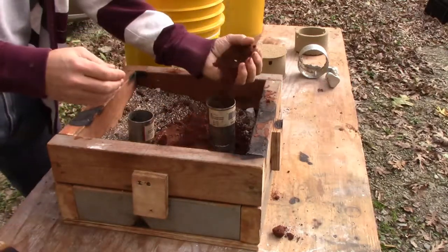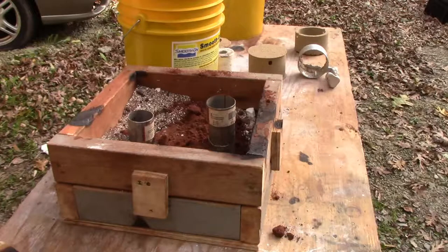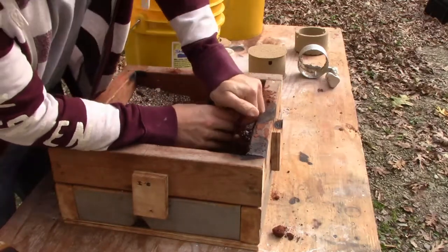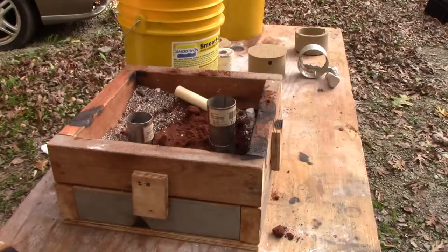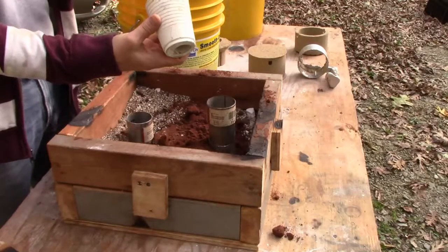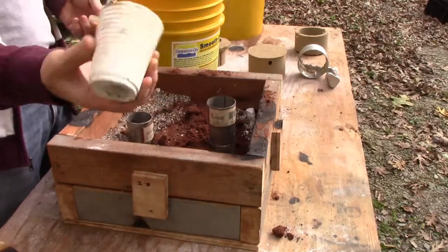Now at the bottom of my riser, I put a little bit of Petrobond, and I'm going to tap that down. And I basically have a piece of PVC pipe that I filled full of plaster, because I use it for my cup riser that I made the other day. I'll show you that. It's a plaster riser. Where'd that thing go? Oh, right here. This was a plastic, it's out of a simple cup, and I pretty much just put a pipe in there, and when it was still a little wet, I pulled it. These work really great for filling.